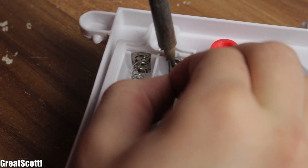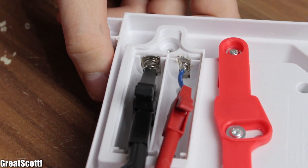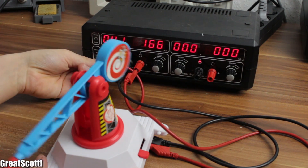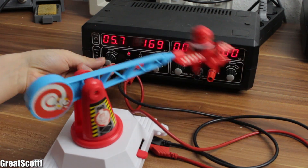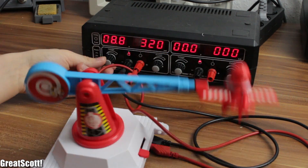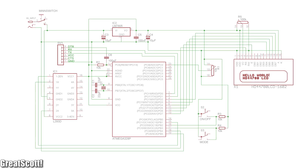First, let's see what the motor can handle. I hooked up my power wires to the positive and negative terminal of the battery holder, then fired up my power supply. 2.5 volts was the normal voltage and it draws around 100 milliamps. I increased the voltage up to 9 volts and not higher, because the game was beginning to shake and got unstable. At 9 volts it draws around 350 milliamps and the speed is really fast, which will make the game more difficult.